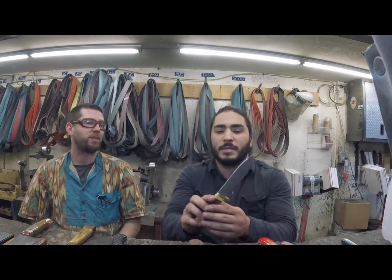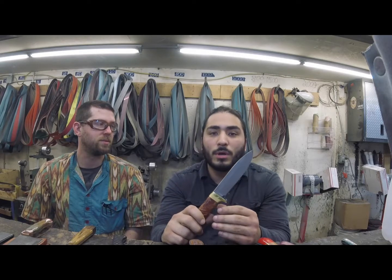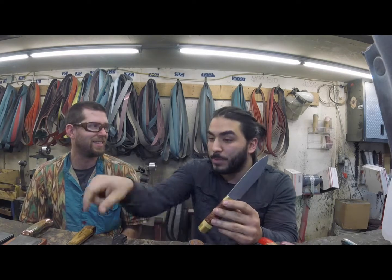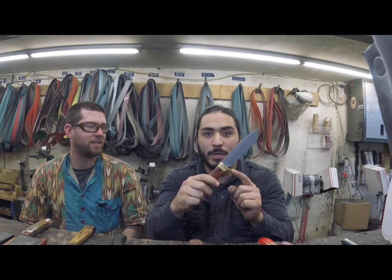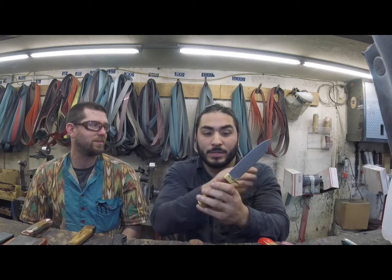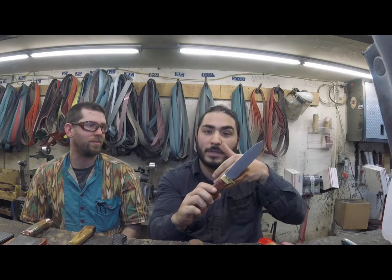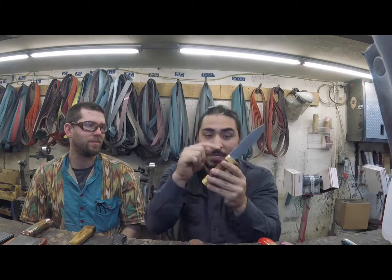And just before we wrap up this video, guys, to touch on our guards here, there's no set of already pre-made, pre-drilled guards that we buy and just pick out and slap onto a knife. Each one of these guards on any knife that it's made for is specifically made for that knife. It's never duplicated in any kind of series. So this started out as a piece of just straight brass. We mill it out or file it out, whatever we do to get our knife in there. There's multiple ways to do it. And we fit this guard, design it, shape it specifically for this knife.